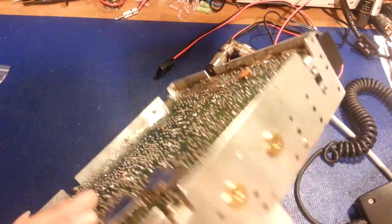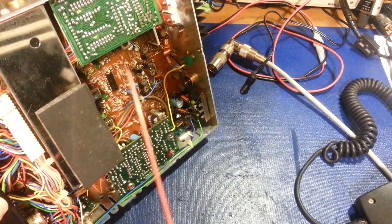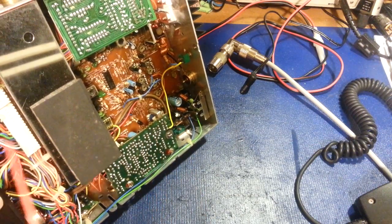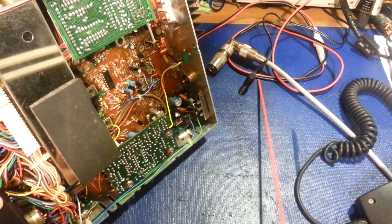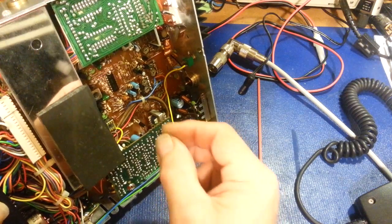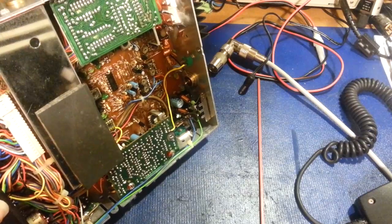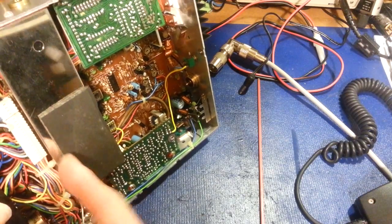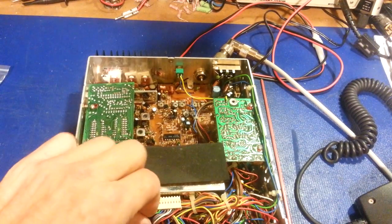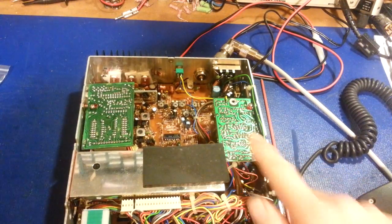Any mobile radio — not just this style — pretty much the majority have components facing down. Any time you see large blobs of wiring harness going to big connector sockets, make sure you check those connections, because every time you hit a bump it's basically trying to rip itself out of the circuit board. If you're having frequency counter problems in this radio, just check the connections right here. The wiring harness can put stress on those header sockets — same thing with the echo board and the binary board over here, which is just an adder board for the PLL circuit.